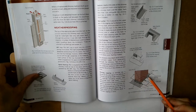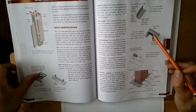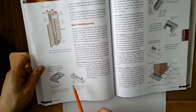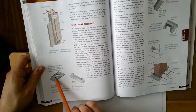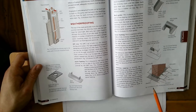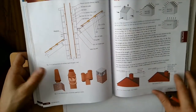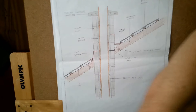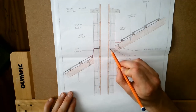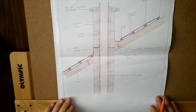There's lead flashing on the front, up the side, and on the back of the chimney. You've got a lead flashing apron on the front, and this whole section which goes through the entire thing — shown in dashed lines. There's an awful lot of detail put in place to make the chimney waterproof. Red pen represents lead flashing, and black pen represents the tray that goes through it.